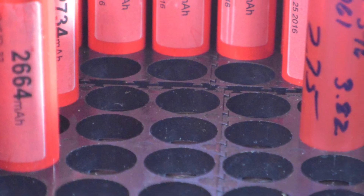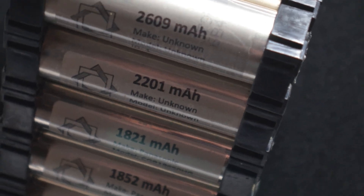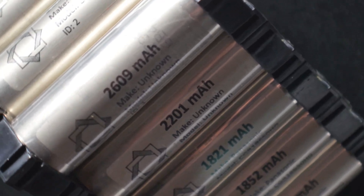So it's good to be able to re-skin a cell. Another reason is so that the cells will fit in the cell holders. If you have a cell that you're trying to mount into these cell holders to make cell packs, the cell needs to be able to fit. You don't want something that's too tight or weird, and if you have to force it in, you could actually cause problems. It's best to have a good fresh skin so that when you're using those cell holders, you're not going to have items that are damaged or mucky.